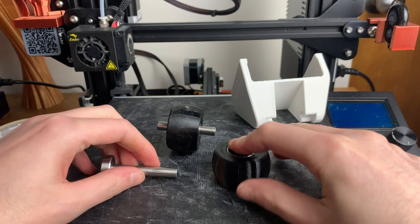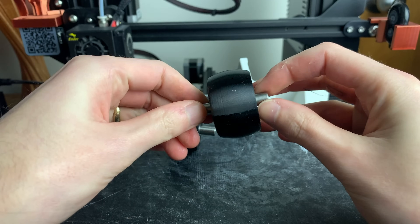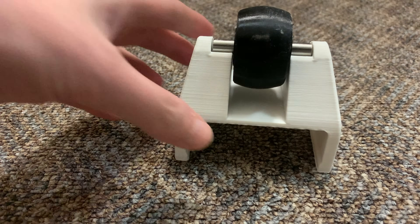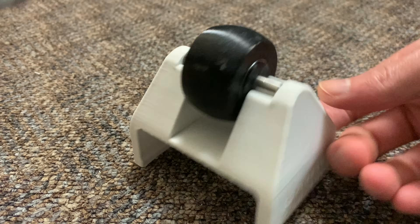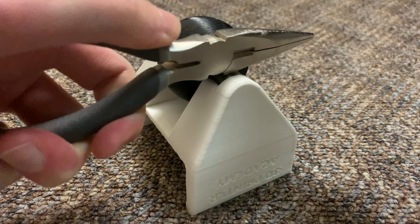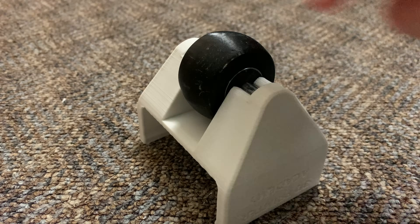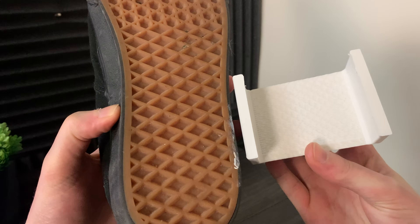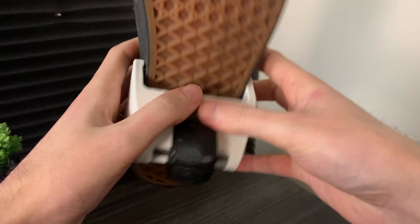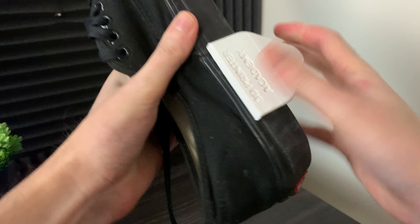At this point I had both solid wheels and you can see how they assemble — just the 8 millimeter rod and the two standard skateboard bearings. I designed the snapping mechanism for the axle to be pretty strong so it does require a lot of force to get the axle into the housing. It's actually really easy to put the housing onto a shoe — you just place it on and if you squeeze the top part of the sole it just clips right into place. This is designed for my specific shoe but I chose to design it for Vans because a lot of people already own Vans.